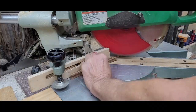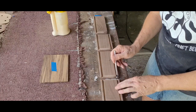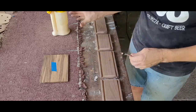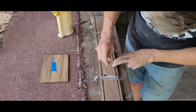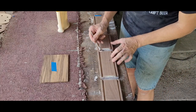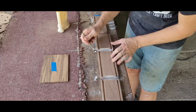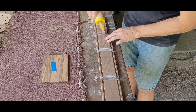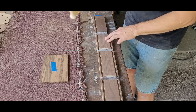Now it's time to assemble the box itself. As usual, I pre-sanded the interior, including the bottom, through 320 grit. Then I used blue tape on each of the joints to act both as a hinge and a clamp. Then I used an acid brush that I had trimmed short to apply glue on both sides of the joint. End grain can suck up a lot of glue, so you want to make sure you get good coverage. Just not so much that you get a lot of squeeze out.